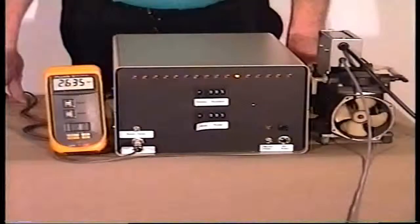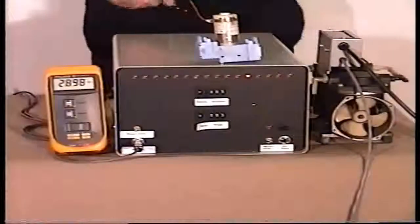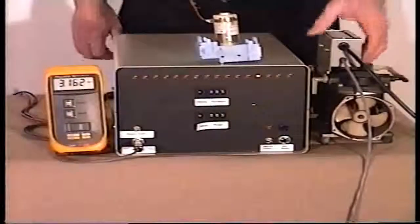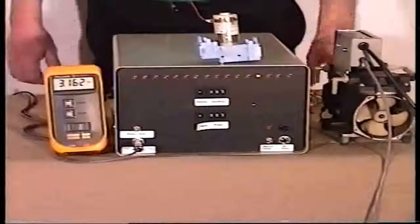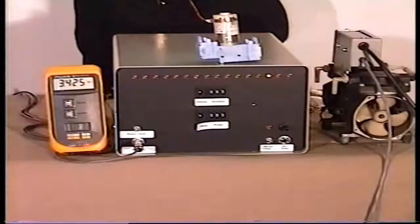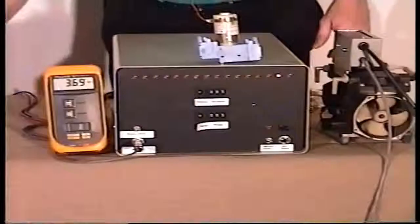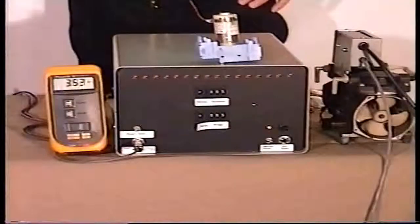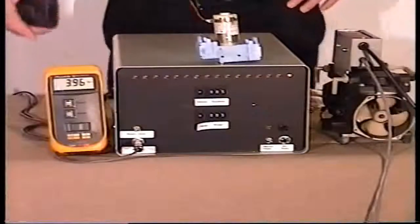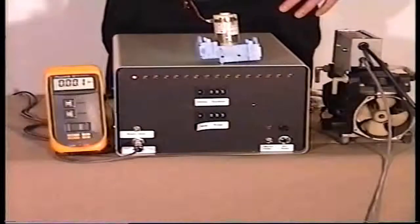We'll take it up to 16 valves and then shut it down. Here's the 12-volt purge pump that we can put inside this sequencer — there's plenty of room in there, and it would be a replacement for the Thomas pump. Also, if necessary, you can tap the outputs of some of the valves and possibly run something else — you've got a switch in there that handles 12 volts at 2 amps, so there's a lot of potential. There we are — there's number 16. As you can see, you have almost 4 volts output on the number 16 valve. We're back into purge and then we'll start all over again with number 1 valve.